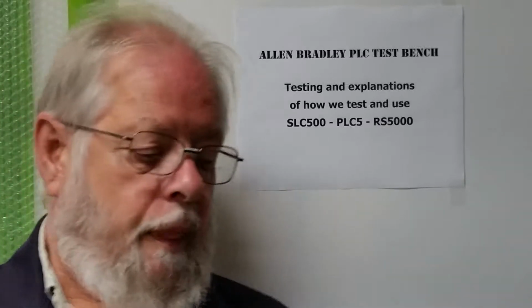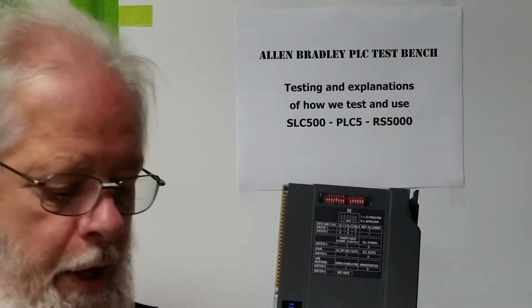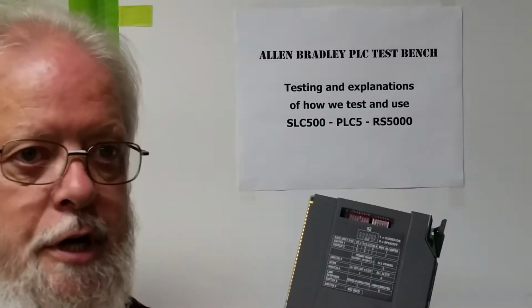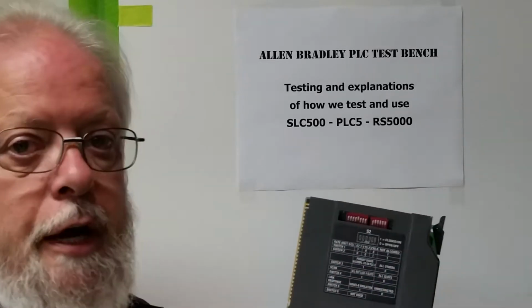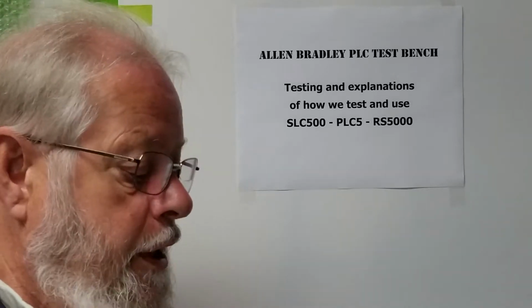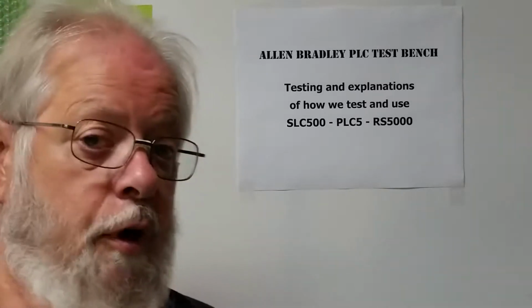They're pretty simple. There are a set of dip switches here, and to change dip switches, don't ever use a pencil. What I've got here is an oil seal pick. It has a very sharp end on it. There's various items you can get like this, and you just flip your switches back and forth. Very simple. Pencils have been known to break off, and graphite can actually play with the resistive properties of these switches and make it so they don't work right and give you errors.